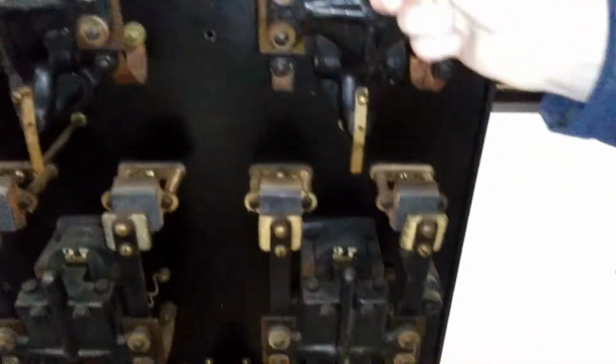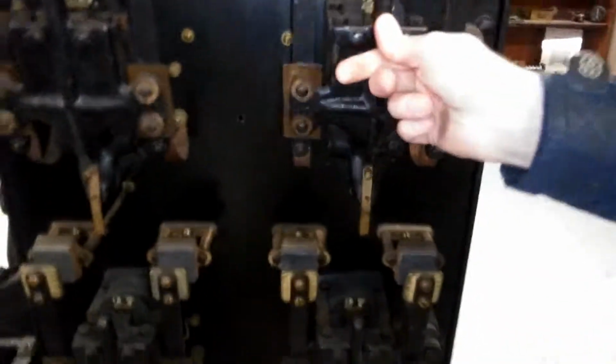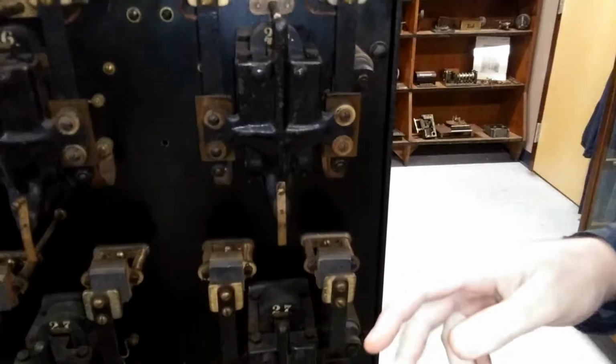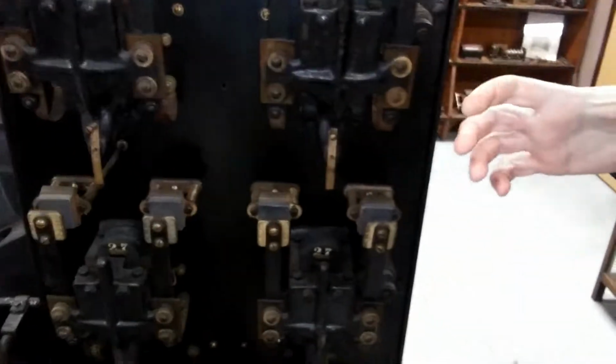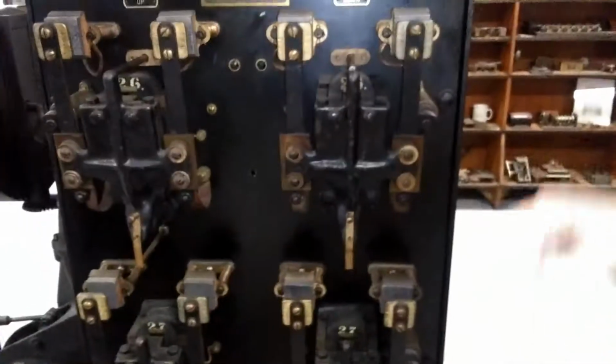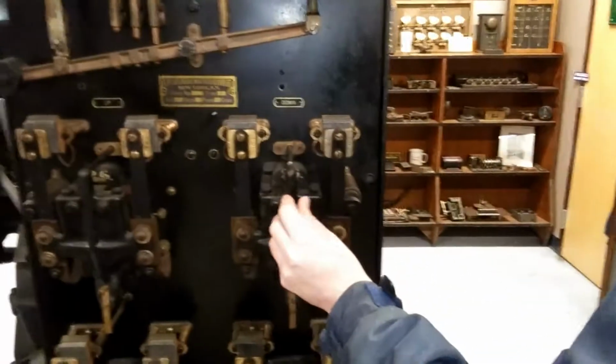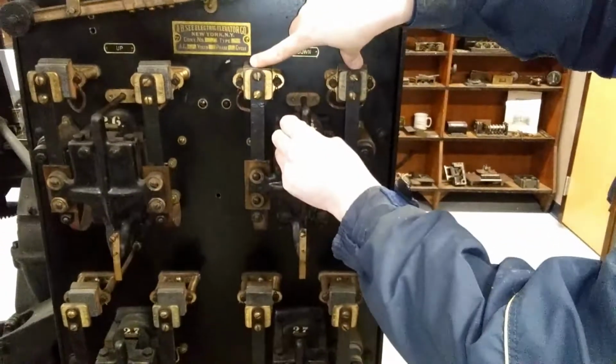Yes. So here's the controller. Never touch one of these when it's installed because there's deadly voltages in here, but there's no deadly voltage in there, so I could always touch it. Okay. You know. And then, bam, a big spark would fly. Oh, they shut when the floor is selected? Well, it's a magnetic switch because you don't want to have huge voltage carriers going up to those little teeny tiny buttons. Right. The teeny buttons control the current that goes to the electromagnet, which is much smaller. And when the electromagnet's activated, it pulls these two, which gets a huge honking current down.